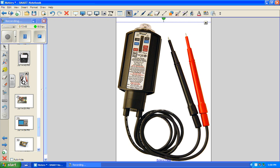If you're going to touch a meter panel, you've got to wear an arc flash suit because many people have been injured. I was an expert witness in a case where a guy was trying to take a breaker out of a 480 three-phase panel served directly by a 1,500-amp set of three-phase fuses. He arced it and it set him on fire from the waist up — we know because of the security video showing him running down the hallway on fire. Because of that, everyone who touches a live panel now must wear an arc flash suit.